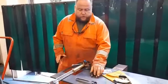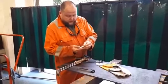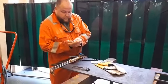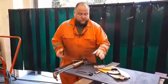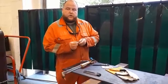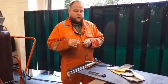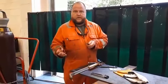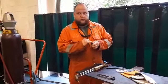I've got a couple of nozzles here which I can show you. There are two differences — one is a 3/64 and the other one is a 16th. What that basically means is the nozzle size itself: one is slightly bigger than the other in terms of the holes in the end of the nozzle. The bigger the outer holes, the amount of pre-flow — so the amount you can preheat the material — is greater the thicker the piece of material you're going to be cutting. So as the material thickness is greater, so does the hole size increase as well.